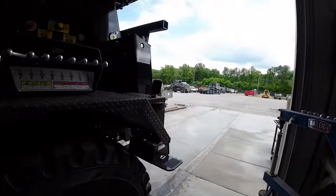Double check all the lights. Kevin's got all the lights and stuff looking good in here. Gotta make sure all the controls work. We got remotes for the auxiliary hydraulics on this wrecker boom, and we've got those winches remoted too, so we're gonna test all that stuff out. So this cable, we got two 55,000 pound winches up there, so my theory is we can pull that cable out. We can run a snatch block right here, short chain or something. And of course that boom lifts up or down, so we can control the height of that cable from that winch up there. You know, if we want to pull out the side, we can, or what have you. But yeah, I think we're about ready for winch cables. Coming up next.